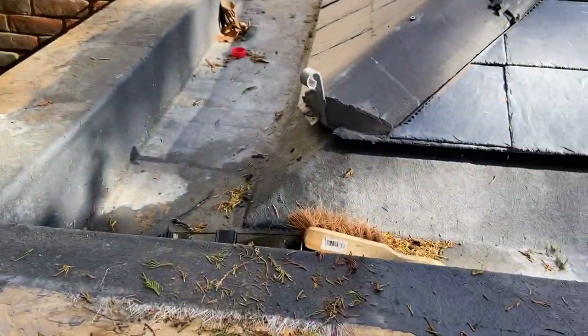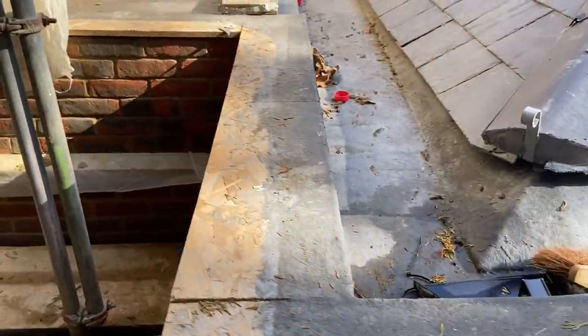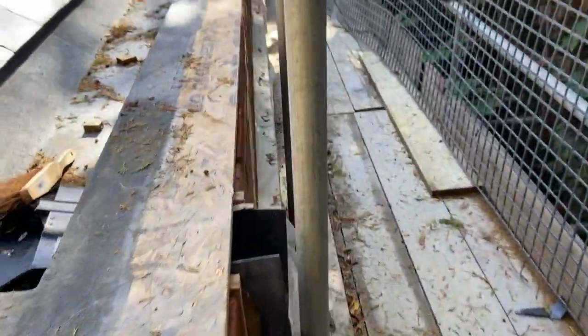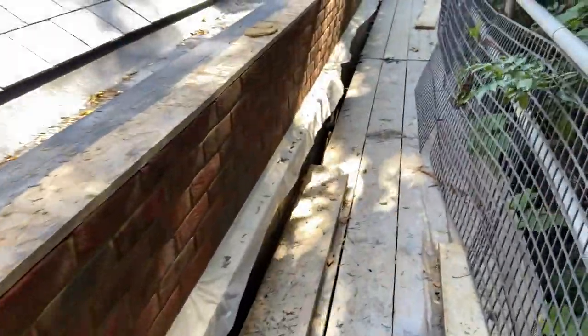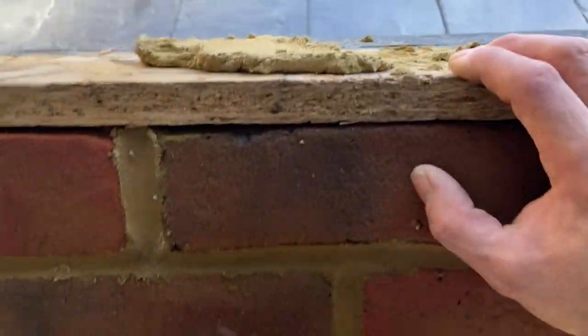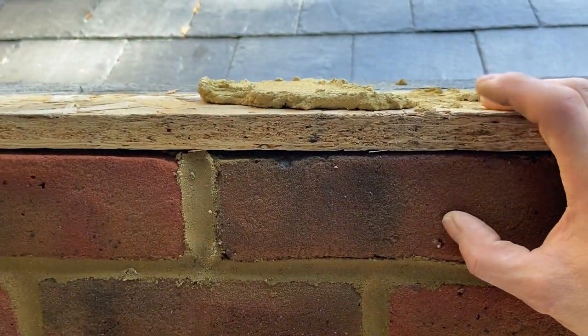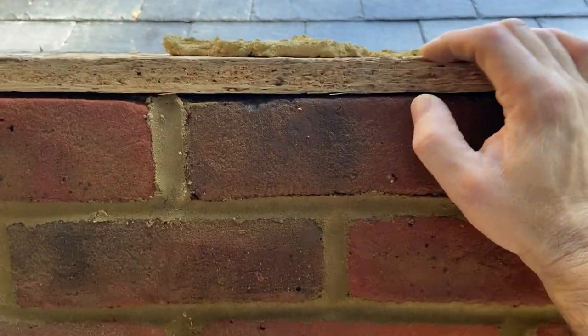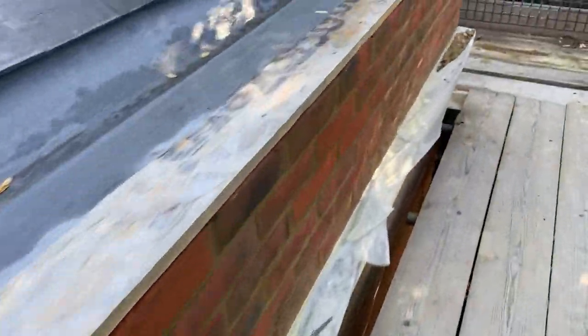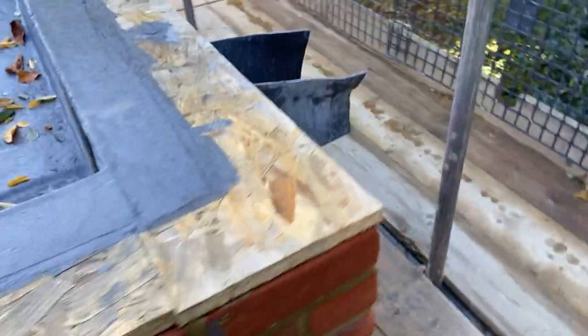Through there. So I've got coping stones going on top of this as well. So it's just copying really what's been done before on this job by someone else. They gave it quite a big downstand actually on this side. They gave it 75 mil, or 70 or 75 mil. I need to double check that, so I'm getting both the same. So there is a fair amount to do, and keep me busy for a couple of hours, wasn't it?